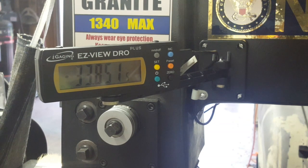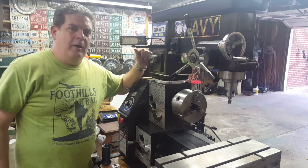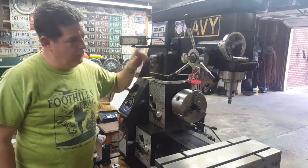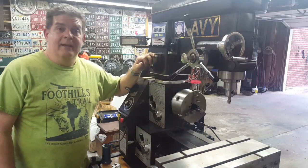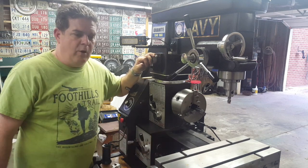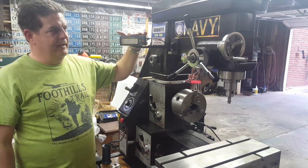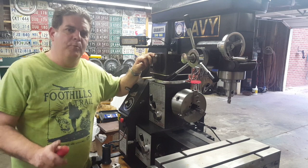Turning it on — we're reading 33.8 inches. That's the full travel from all the way up until it stops at the chuck to all the way back until it hits the tailstock. That wraps up the X-axis digital readout installation — it's mounted, the wire is run and clamped down, and everything looks good. The next video in this series will cover the Y-axis on the cross-slide table, and we'll just stack that readout right on top of this X-axis one. Thanks for watching, and I hope you come back for the next one.